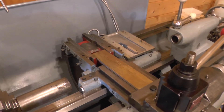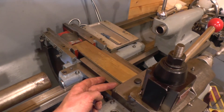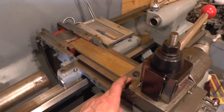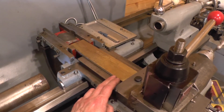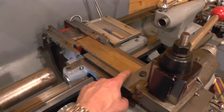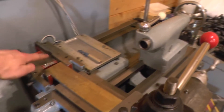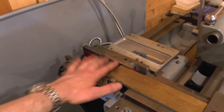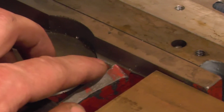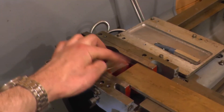This bit of roughly quarter-inch, six-millimeter aluminium plate is attached to the underside of the cross slide. I machined a recess for it to bolt into. As standard, this was a piece of sheet steel, so I've lost a little bit of height over the ways, but this surface is still below the surface of the cross slide. I had to do a little bit of machining in the slider block of the taper turning attachment. If I zoom in, you can see that step — that's how much I took out of that side, just so that this extension would clear through.